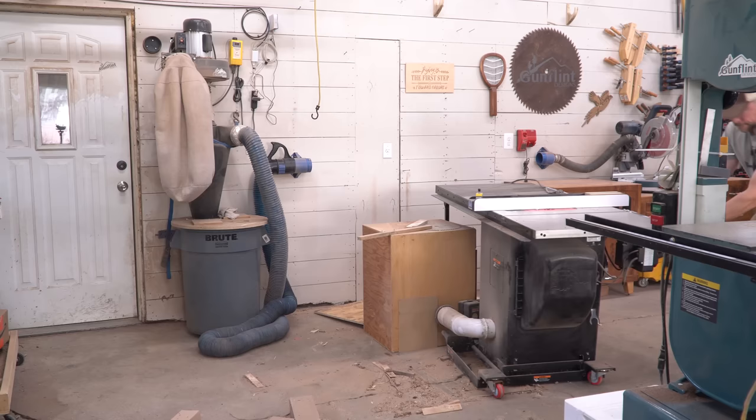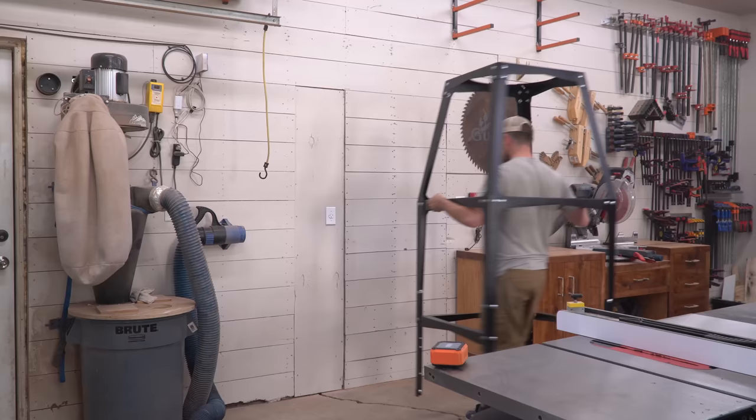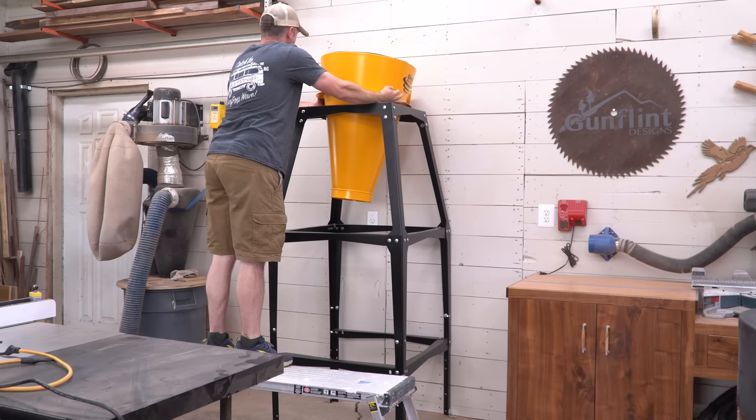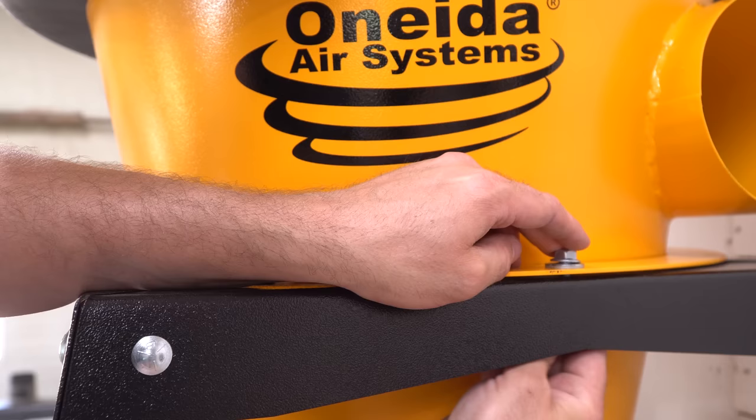I did have to make a few tweaks after I moved it to its permanent home because my floor is very uneven and full of cracks from frost heaving. I spent a bit of time dismantling part of my shop to make room for the new collector. As it turned out, I ended up making an even more drastic change to my layout than I had planned, but this whole corner was going to get changed anyway, so it was work that still needed to be done. A foam gasket gets installed on top of the cyclone to create an airtight seal against the bottom of the fan housing. Then the cyclone goes into the frame with the inlet pointed in the direction indicated by the layout map, and gets lined up with the mounting holes before installing and tightening the bolts.